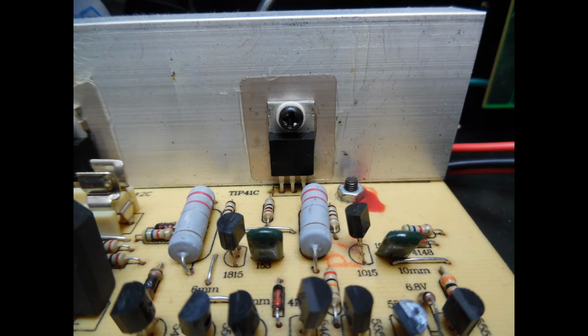But when these amplifiers fail, remember, if the fuse protection doesn't blow, you could have high DC up to rail potential delivered through to the speaker coil. So whenever you undertake any kind of repair like this, check with the customer before they receive it back to verify: can you check your speaker, make sure that it wasn't damaged when the amplifier failed. So really quite a straightforward repair from a component point of view. Replacement of the TIP output transistors, new heatsink compound was applied, and the 220 ohm resistor was also replaced.